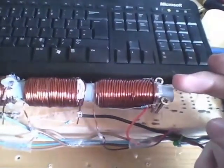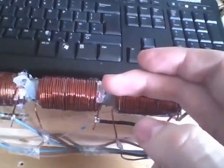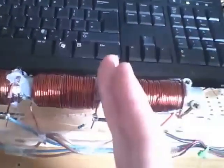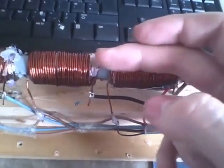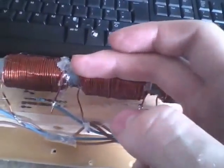But because it goes at such a high velocity towards the middle, it will just have enough energy to break past the middle and poke out the other end. And that will trigger the gate to turn off that coil. If it didn't, the projectile would just get sucked back into the same coil. But because it's turned off, it allows the projectile to get sucked into the next one, then the light barrier turns that one off, and on to the next one, and then eventually straight out the barrel.